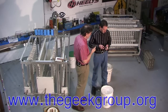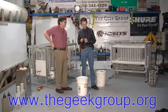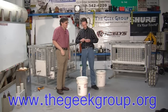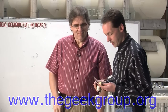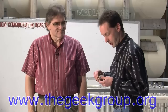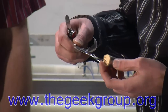The difference between pulse caps, and these are pulse-rated caps, and non-pulse-rated caps has to do with not just what they're made of, but how they're made. And a big part of that is the ends. Now, the ends on these... I'm going to have a little trouble because of the scorching. I'm having a bit of difficulty. I'm just going to carve into it. Now the ends on these are all together.